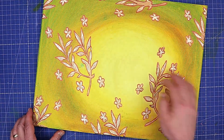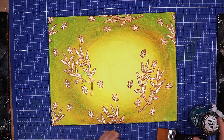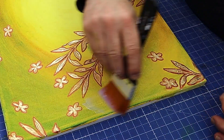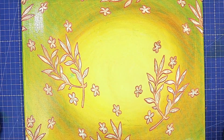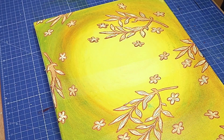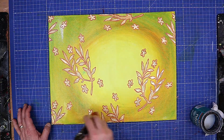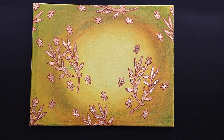Now it's time to finish it off. I'm going to give it a coat of semi-gloss poly acrylic using a soft bristle flat brush, and I'll probably give it two coats. I always go up and down first and then across when I put it on. If you don't want a sheen you can always use a matte varnish, but I like the way the semi-gloss makes everything pop once it's dry - especially these yellows.